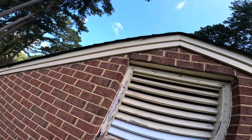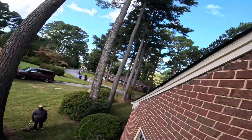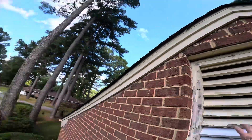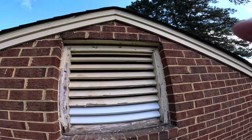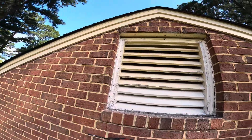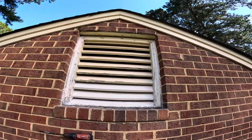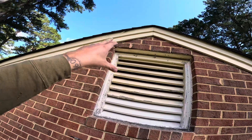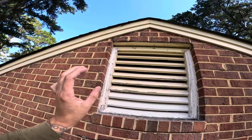Then I'm going to paint these, and I'll get a metal border on the outside with some screen in between that metal so it'll be completely blocked — they're not going to be able to chew through any of this. I repainted the bottom three; it's not quite the right color match but it does the job and the customer is okay with it. So we're going to continue and make a border out of aluminum with quarter-inch hardware cloth enclosed in it and hem it together.